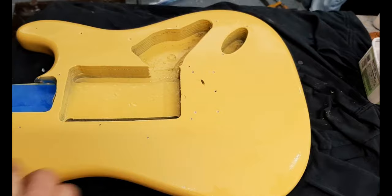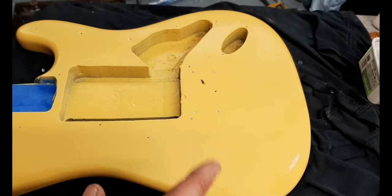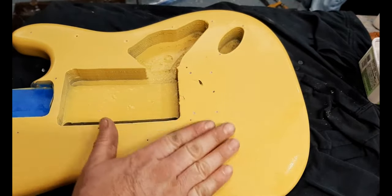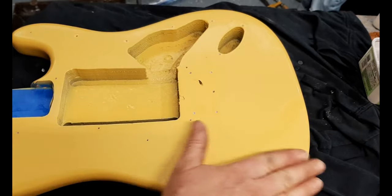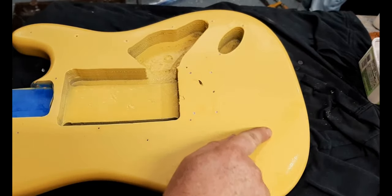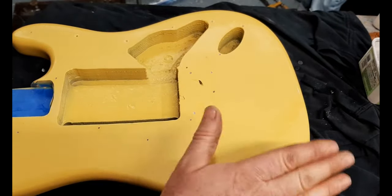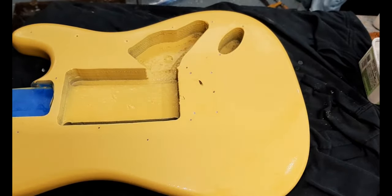How do you know when you're done? You just kind of feel like it's as smooth as it's going to get, and you don't want to overdo it. When I was done with all the layers of different grades of sandpaper and it wasn't as smooth as I liked, I went back and did it over again. Just as long as you have enough layers of clear coat. With this type of guitar - a Stratocaster - it doesn't matter as much. As I was sanding I almost wanted to sand through here because I thought it would look good like wear, but I decided I'd decide that later. Now I'm switching to 1500 and going in the opposite direction.